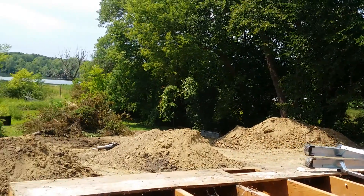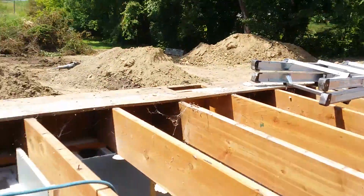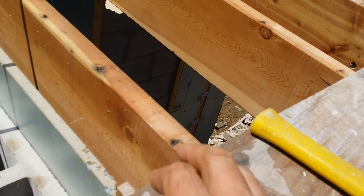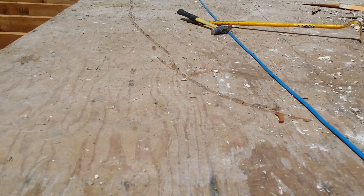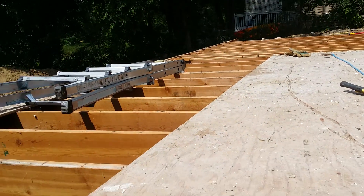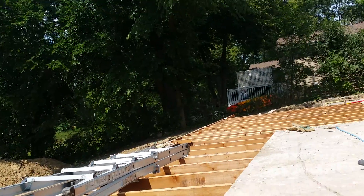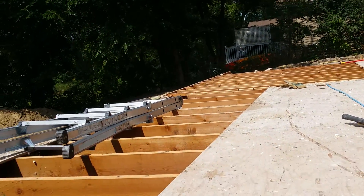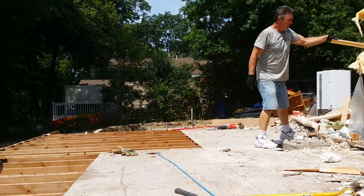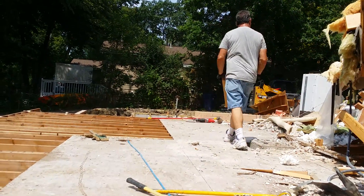John and his brother are taking off all of the floor joists and all of the sheathing. Based on his recommendation, we're going to go up three more feet — three more courses — and that'll give us a nine-foot-nine basement with nine inches for ducting and the like.